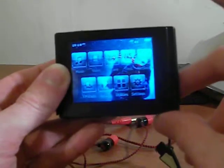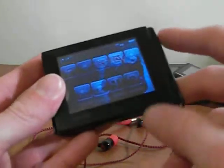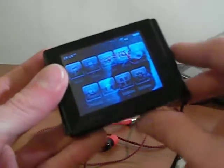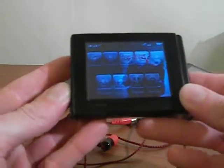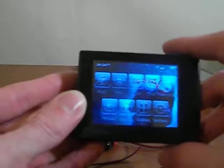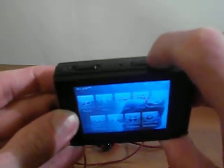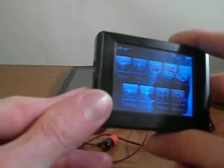The D2 uses a separate touch controller for the screen, while the D2 Plus uses a dedicated on-chip controller. So of course the D2 touchscreen driver embedded in the firmware is not going to work with the D2 Plus touchscreen driver because they're different. What I had to do was — the D2 Plus was being detected normally even when I held the menu button for recovery mode — I had to quickly disconnect and reconnect really fast, and then TCC tool was able to detect the device and I was able to bring my D2 Plus back to life.